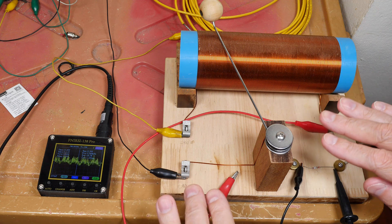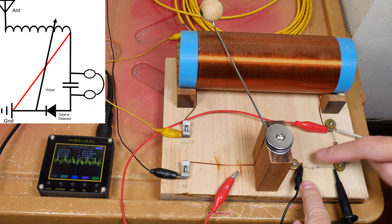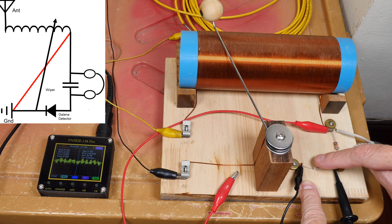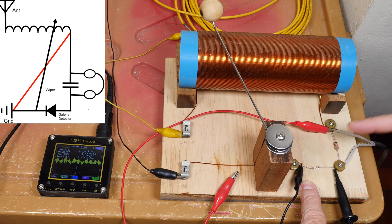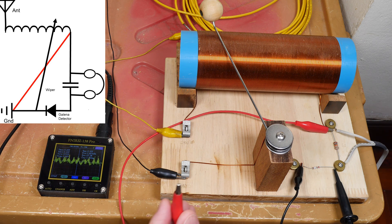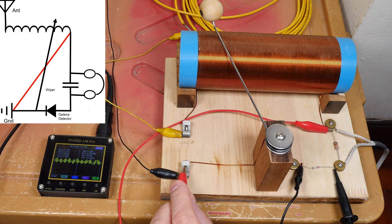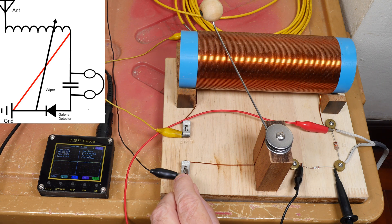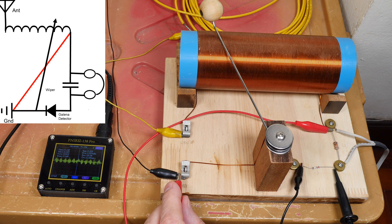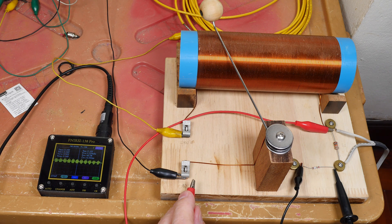This is our typical crystal radio setup. We have our antenna wire coming in here and our ground wire here. The oscilloscope is looking at the difference across the detector, which is in this case a diode, and it's basically showing you what I'm hearing. You can see over here — it's a woman talking. So let's see what happens when we connect in the red wire, which is what was in the original diagram from the Cub Scout manual. Yeah — nothing. Voice? Nothing. I mean, it goes totally dead. I don't hear anything, not even static.